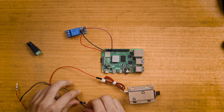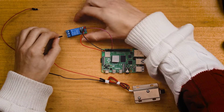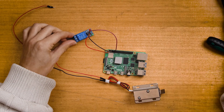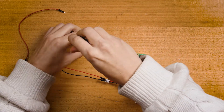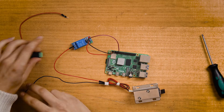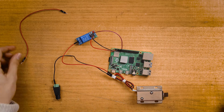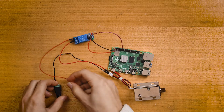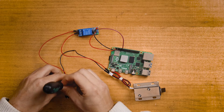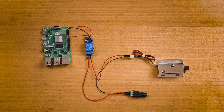Moving attention to the solenoid, attach the ground wire to the ground connection on the DC power jack by screwing it into place with a screwdriver. Then attach the solenoid positive to the middle connection on the relay, and the positive side of the power jack to the pin on the top of the relay by screwing them down. The top of the board is determined by following the orientation of the words printed on top of the blue box, which conceals the relay's mechanical mechanism. The pin on the bottom is left empty.